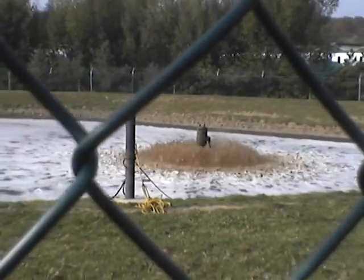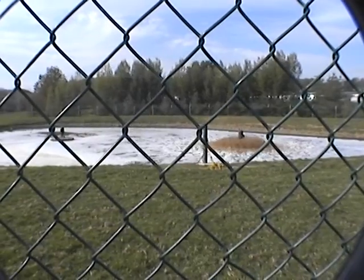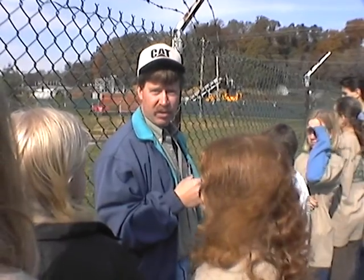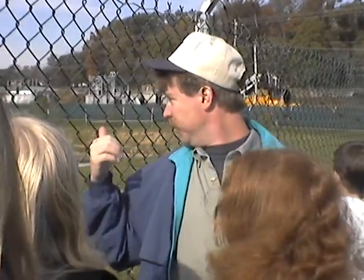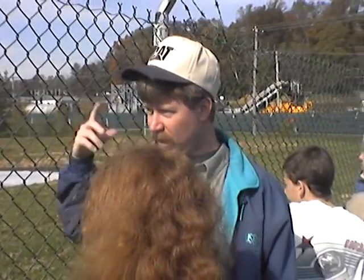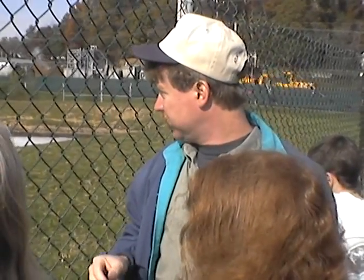All the rainwater, all the storage area, and all the concrete, we have to keep by law. We don't let anything go out of the wharf area. Everything has to be contained here. The machine you see running there is what we call an aerator. All that's doing is keeping the water circulating, so the outside air keeps it aerobic, so it doesn't build up methane gases and start to smell.